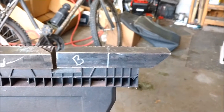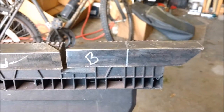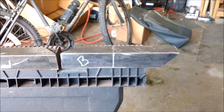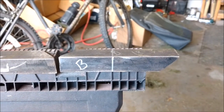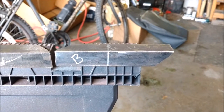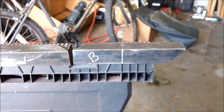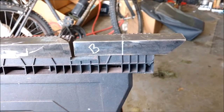This part of the mount is nearly done. I do have to put a little twist in it so that it matches the curve of the fender. In order to do that, before I weld anything to the frame, I'm gonna cut about three-quarters of the way up on each side. Then I'll be able to twist it, because you're not gonna twist a 6-inch piece of angle iron — not when it's only 6 inches long, even if it is only eighth-inch. I'll hold it up on the frame to get an idea of where everything's gotta twist to, then tack weld it back together. I'm not a welder, but I can get by. I'll do that to both pieces and then get the one-by welded on.